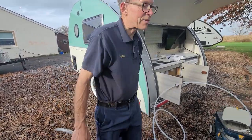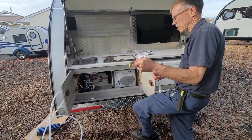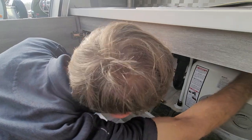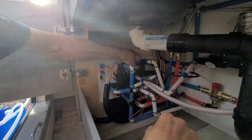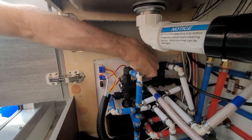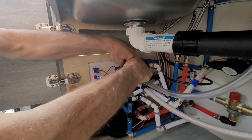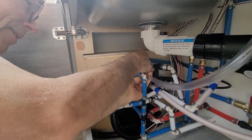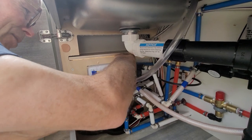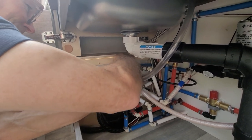The next step is to get the hot water out of the hot water heater. I'm going to take this special hose I made up and disconnect the blue pipe that goes to the top of the hot water heater — I'll disconnect it over here at the Nautilus system because that's easier than reaching up over top. Once I get it disconnected, I'll put this hose in place and screw it tight. I want to be sure the packing stayed in there so it has a good connection. Finger tight is all that's needed.